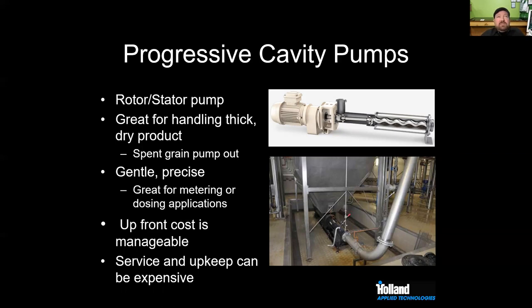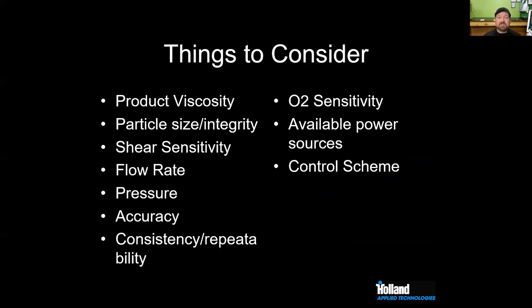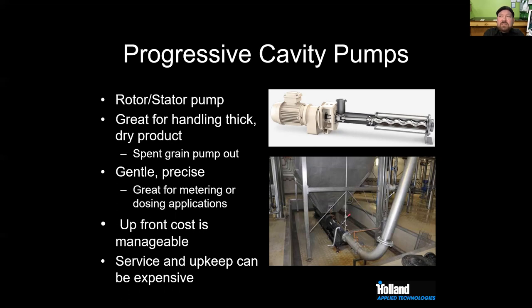Well, the spent grain is the leftover husk material from our malted barley that we use to extract the sugar from. But that spent grain is still coated in lactobacillus, which is a souring bacteria. And we need to get rid of it out of the brew house in a timely manner, because it's going to start rotting. And also it just holds up production. So the faster we can get it out of the brew house, the better. It's heavy, it's wet. It's not fun to rake out of a mash tun, so I would love a pump.